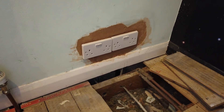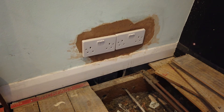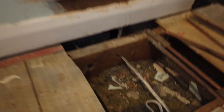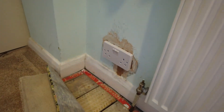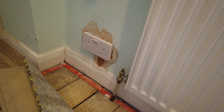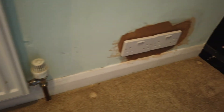Everything's in, bonded, not tightened up fully yet. Wait for the bonding to dry and then put a little skim on it tomorrow. We've got our maintenance free Wago box with the ring split, and that then runs over to here — again bonded, needs finishing round it. Sockets are all in, all tested, everything's good. Carpet's back down. Bonding around the sockets so that just needs a finish, which we'll get on with at some other point. All done.